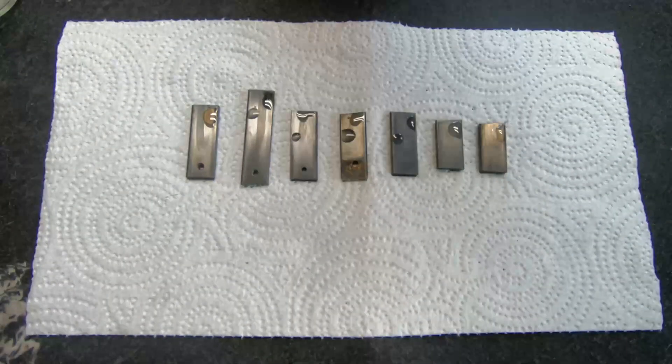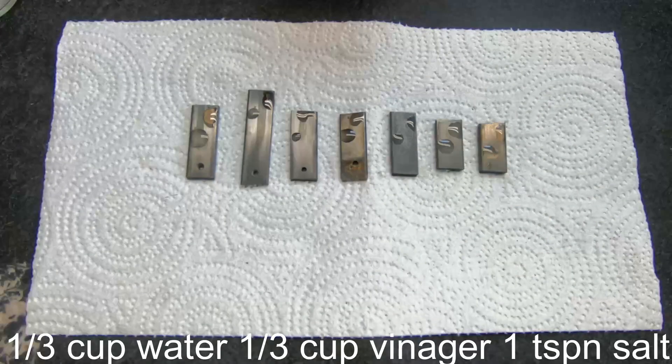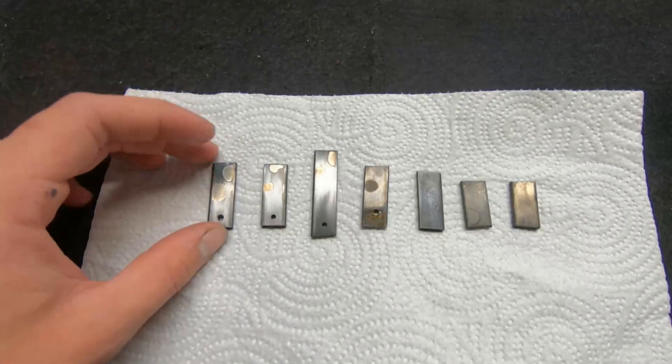Speeding things up with a very harsh test using a heated pickling solution, we can see how quickly it eats through these pieces, and after 15 minutes we have varied results. I realized I wasn't dipping the swab back into the solution between each piece, which meant the solution wasn't at a consistent heat when I applied it. So I did a second set of blotches — the lower ones — which are more consistent in size and temperature, and the results are far closer.